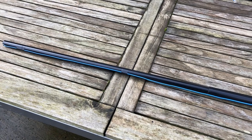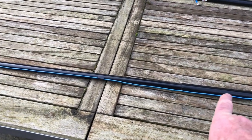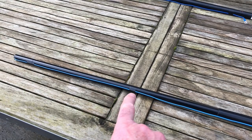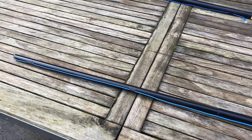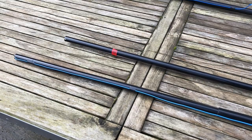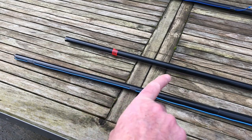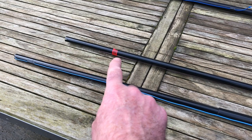So this is the end of the reflector, that 90 centimeter return, you remember. This is taped on permanently with my best Scotch tape. This isn't going to move. The other end's loose. Now I'll show the other end of the director. So there you can see we've got a loose wire because the neat one is down that end, just the same as this, all tidied up with black tape. This is a loose end that we're going to wrap around later.